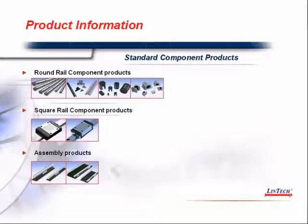Twin rail carriage assemblies have 4 single pillow blocks or 2 double pillow blocks aligned, mounted, and then doweled to an aluminum plate. The plate can also be pre-drilled with stainless steel inserts and is available to mate with the TRSA series. It is available in lengths of 6 to 32 inches long. The pillow blocks have a -L option which provides for a manual locking clamp on the pillow block as well.